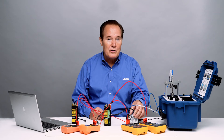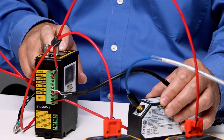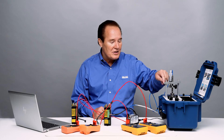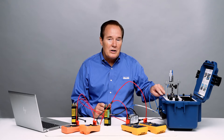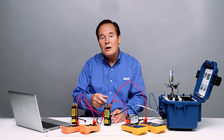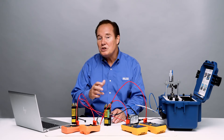Today we have the MX2033 providing a signal to channel one of the SW5580. The MX2033 is connected to a one meter probe that's looking at a target on the Metrix HI903. We're going to be monitoring both position and vibration — channel one has position and channel two will have vibration. We call that the dual path mode: a single channel going in and two channels coming out.